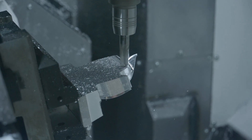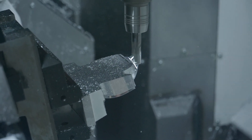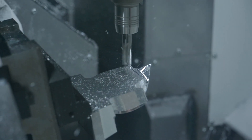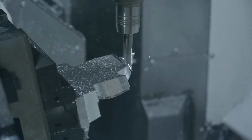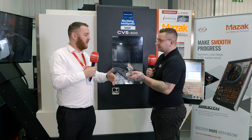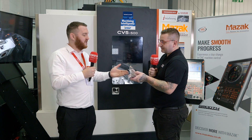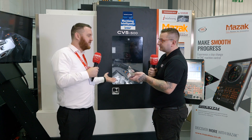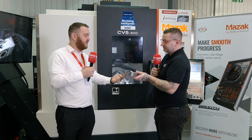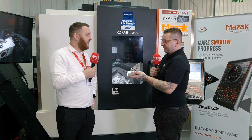What I love from what you were just saying is you actually broke all the edges before you even machined it — because who likes filing? To try and break the edge once it's 2mm thick, you're going to have a lot of ring in that, it's going to bounce, it's going to flex. So do the edge breaking first. You break the edge off with a ball nose — it looks a bit strange on the machine, you're just digging into material — but it cuts nicely, and once you cut the pocket out and the shape's out, the edge break's already there for you.